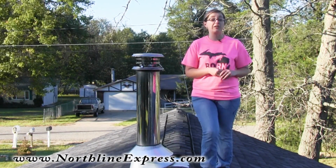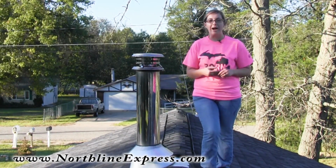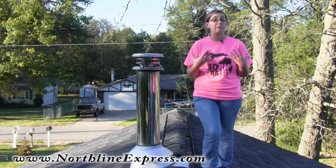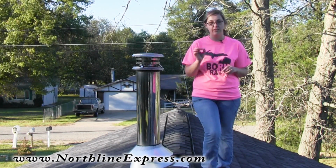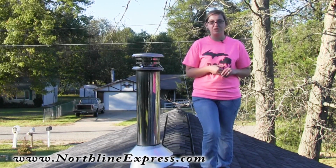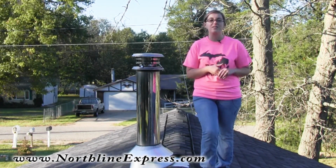First, I want to start by talking about the brush that you use to clean your chimney. When cleaning a Class A chimney, you want to make sure that you're using a poly bristle brush. You don't want to use the metal bristle brushes, even though they may seem like they'll do the job better, because those metal bristles are actually going to scrape down on the inside of your chimney, leaving grooves which are actually going to make creosote build up. So make sure when choosing your chimney brush, you choose a poly bristle brush. It's going to get the job done well, but without leaving behind the scratches and making the creosote build up worse.